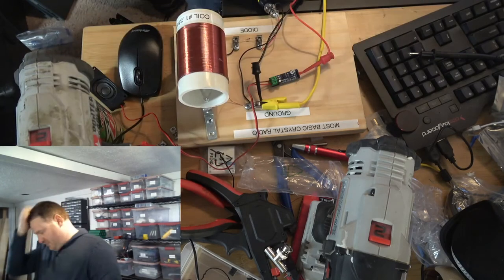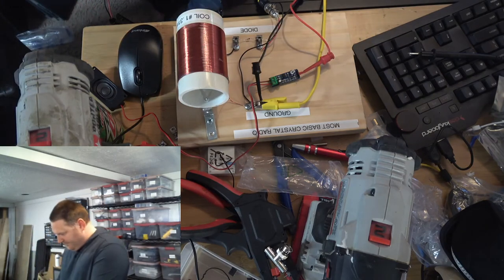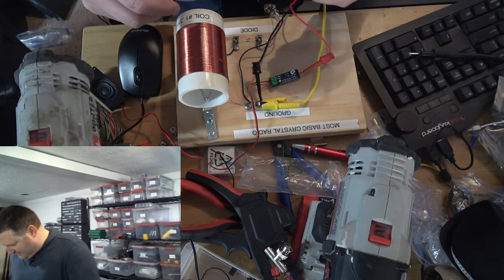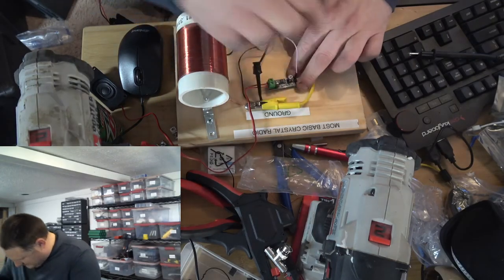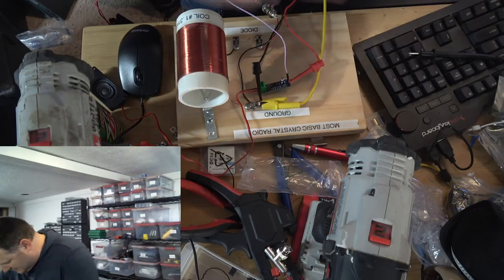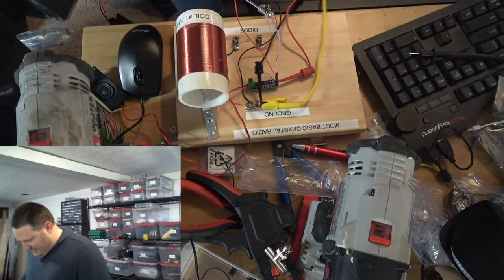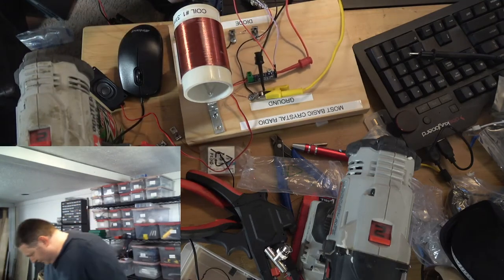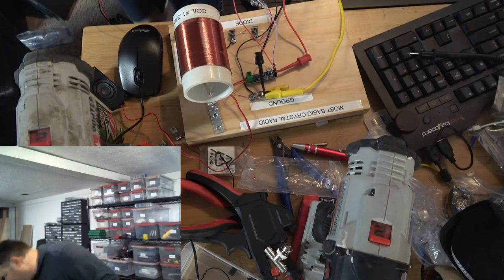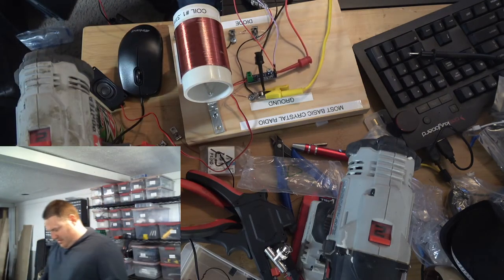On the amp. And then we're going to just give the amp 5 volts DC. So here's a ground connection, and here is a VCC, and then I actually need to tie the grounds together so that everything is at the same ground potential, and we should be able to turn the amplifier on and give you guys a listen. So we're going to take a clip here.